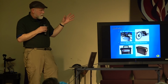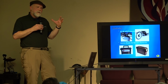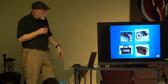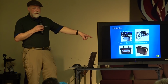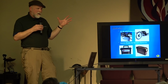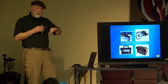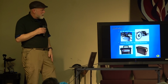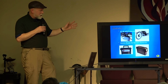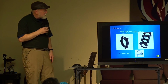If you're rolling your own, this is kind of an old slide now. People don't do that anymore with the new battery packs. But if you just buy a bare brick of batteries that are all strapped together, a great way to do it is put it in a sealed plastic box. As it turns out, this is the United States of America, and for about $6 you can buy a beautiful, sturdy, sealed box called an ammo box. All you have to do is drill a few holes in it to get the wires out, and you've got a super tough box that you can strap all over the place. You know, run screws in to attach to a plate or whatever. They're made out of really tough plastic. So the $6 solution is pretty cool.